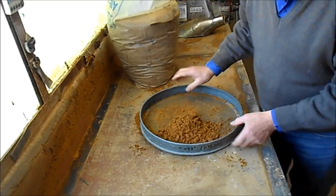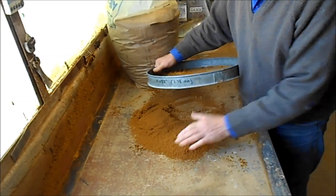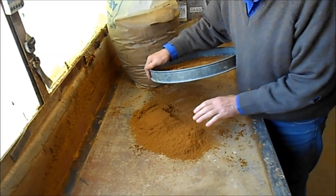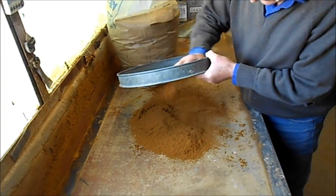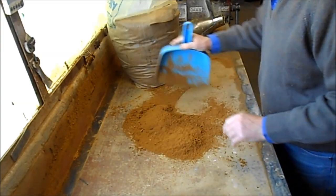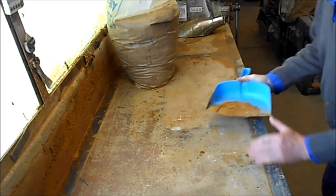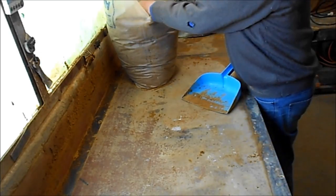The other trick when you sieve it — it falls fairly flat on the bench with a bit of a dome, a bit of a mound, but not too much. If it was dry it would be very flat. If it was very wet, you'd see holes through the sand because it won't sit down flat — it just sort of sticks where it lands. But that's pretty good — I'm very happy with that sand, that'll make a nice mould. I might add that if I was doing a job where I wanted a ready finish I would deliberately run the sand a bit drier, and if I was doing a job where I need sand that's tougher I would deliberately run it a bit wetter.